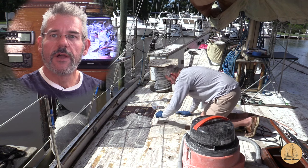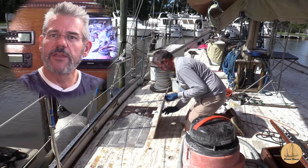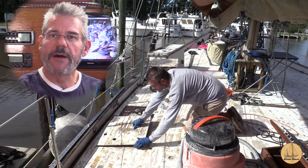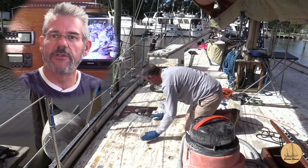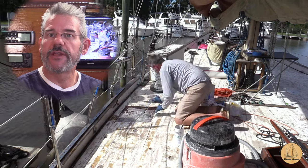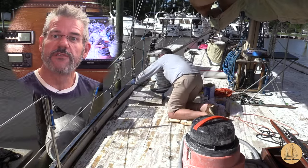I'm going to flip this over and put the two epoxy sides together, mated on the deck itself. I'm lining this up a lot like tile, because when I cut this there's a gap about as wide as the saw blade between each of these pieces. So as I put it down, I want to make sure I maintain that same level of small crack around the whole edge, about the thickness of my original saw blade. I then repeated this with the other two pieces — there are actually three total in this part of the deck.